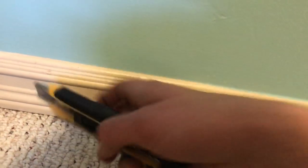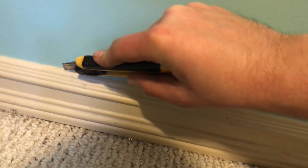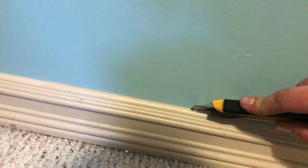And a hammer. So let me show you what we're going to do with these tools to loosen the baseboard. We've painted this room a couple of times — the baseboard here was originally a light color and there's paint that's run along the inside. What you do with the box cutter is run it right along the edge, so that when you go to pull this off it doesn't take a whole bunch of your paint off the wall as well.